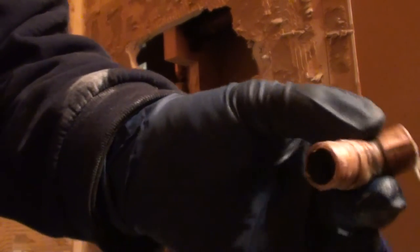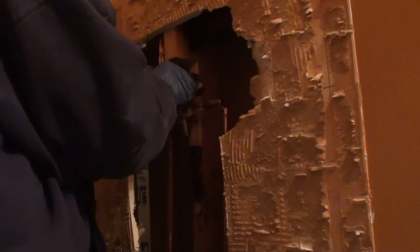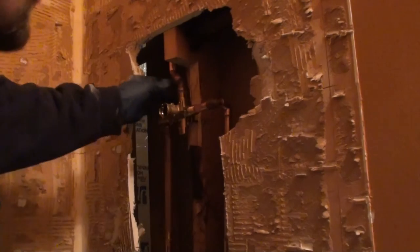So again, I'm heavy on the flux. It's going to be what allows your solder to stick real well. I'm going to put my 45 on first because I've got movement out of my showerhead riser and I can put it on fairly easy. Okay, it's a little tighter than I wanted, but that's okay. Just going to use my channel locks to turn it and get everything to go into place. Here we go, perfect. Show them.